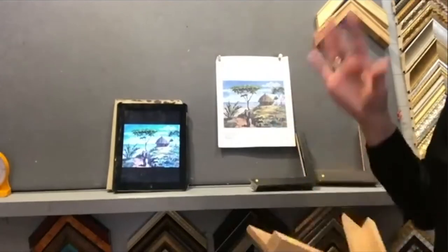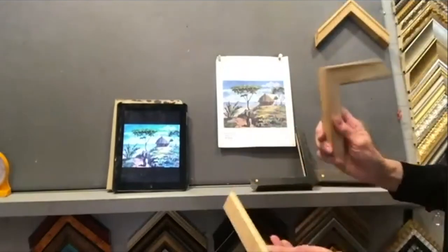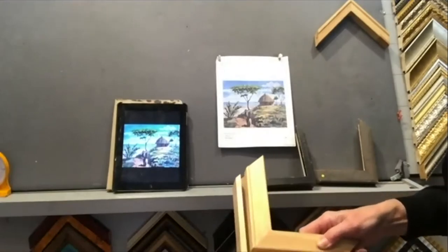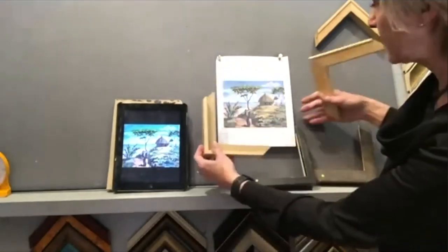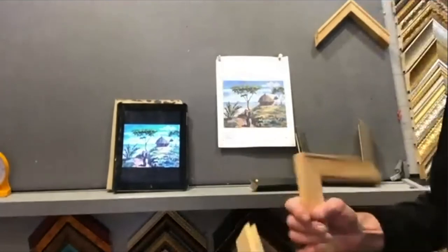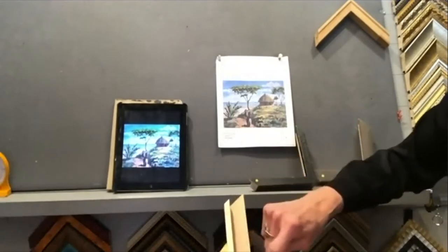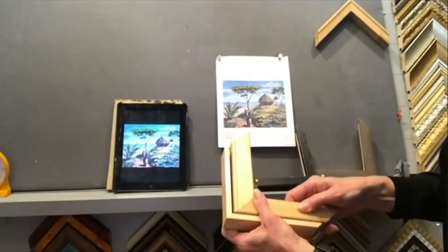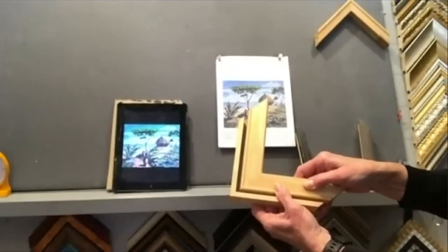And then if you want something just clean and simple, a reveal, since it's a 3/4 inch stretcher, he could just do a simple reveal, the painting. And that brings out the sandy color and so forth. So you understand that you really only see this, right? That this is mechanical back here. This is what you screw in through into the frame. You really only see about that much. Does that make sense? Yes, thank you.